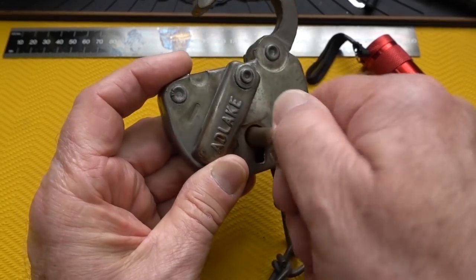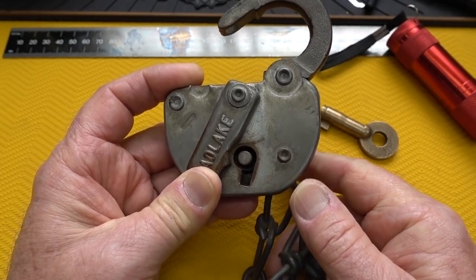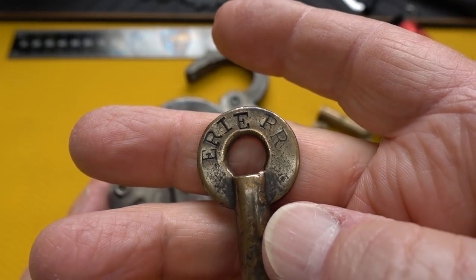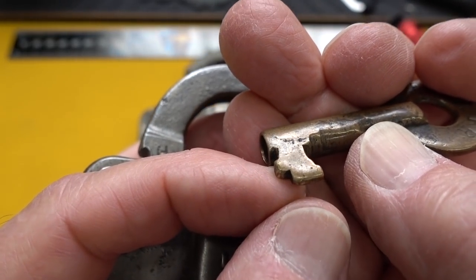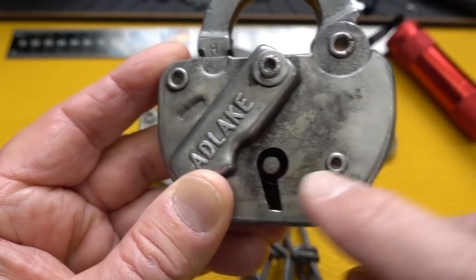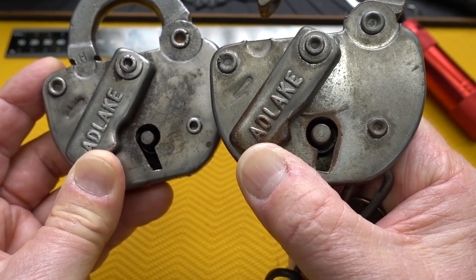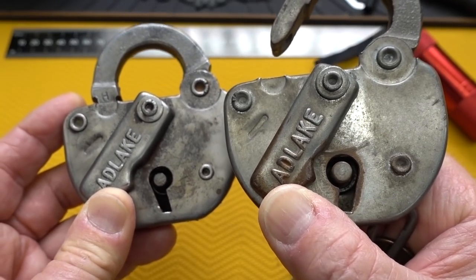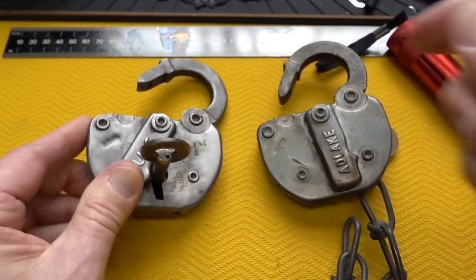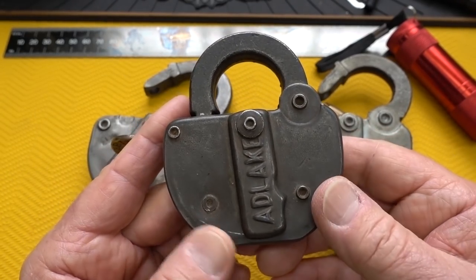Let's talk about something else. Notice the shape of this keyway — it looks like the number nine. I thought about just making a tensioner that would fit all of these, but then another one rolled into the shop. This one is a little different — it's by the Erie Railroad, pretty good shape, nice key, and it's got that same cut. But when you take a look at the keyway on this one, it looks like a mirror image of the number nine. And in addition to that, when you compare it to the other one, not only is it a mirror image, but look at the difference in diameter of that central shaft. So making a key or tensioner that would fit all of these didn't seem very likely.